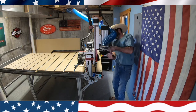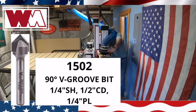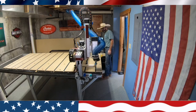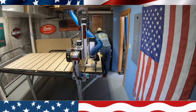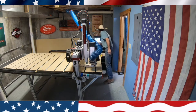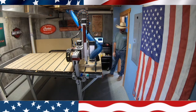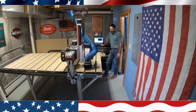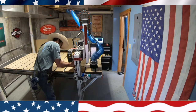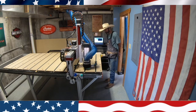The first thing I do is install the 1502 White Side 90-degree V-bit. I set up a jig with the Rockler T-Track to batch out all ten pieces. All I have to do is home the machine and do the XYZ one time, then just hit start ten times. It's a really good way to batch out stuff. I do the first one — it's pretty quick — take it out, put another one in, hit the start button, and repeat ten times.